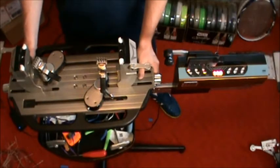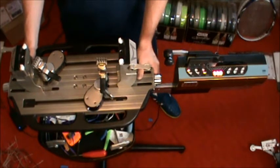Okay, this video is going to be about how to calibrate a lockout machine or a crank machine. All crank machines are lockout machines, which means when they pull tension, the moment that the spring tensioner senses the tension has been achieved, the mechanism will lock out. It will neither go forward nor back, which is a little different than in a constant pull machine.